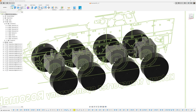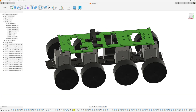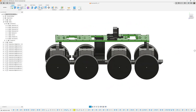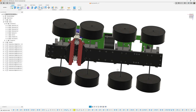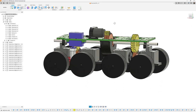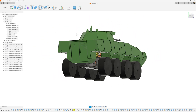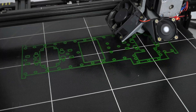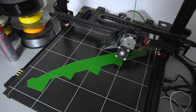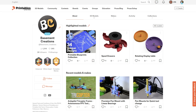The first thing I did was create simplified models of those differentials and align them according to the actual Rosomak blueprint. The whole design consists of four main component groups: an inner frame sub-assembly to which all differentials attach, a servo-powered steering system, a main driveshaft with herringbone transmission gears running the full length of the chassis, and a hull with an additional turret on top. Some parts turned out to be pretty big, but luckily my Anycubic Chiron was up for the task. All components are printed from PLA and can be found on my Printables and Thingiverse profiles.